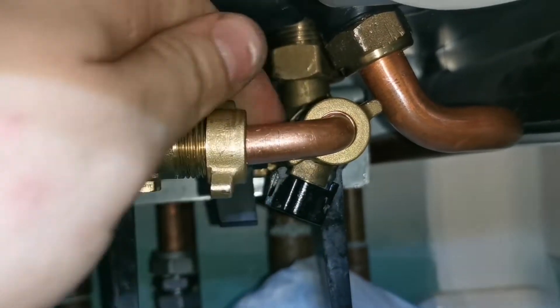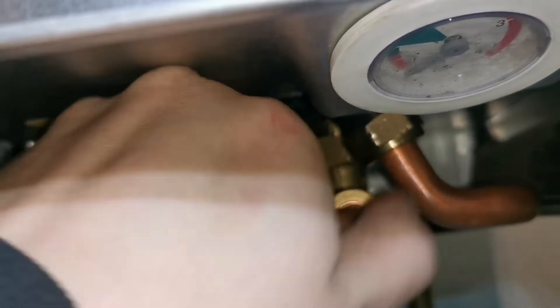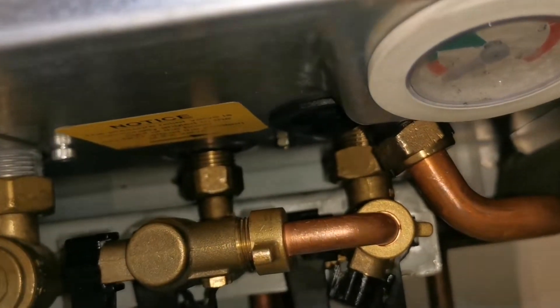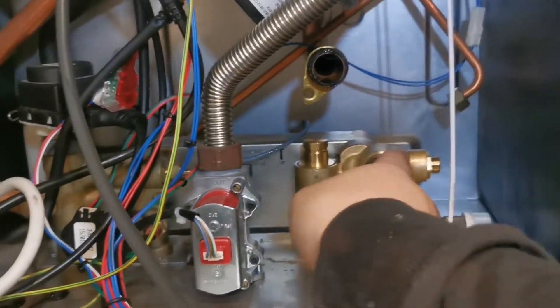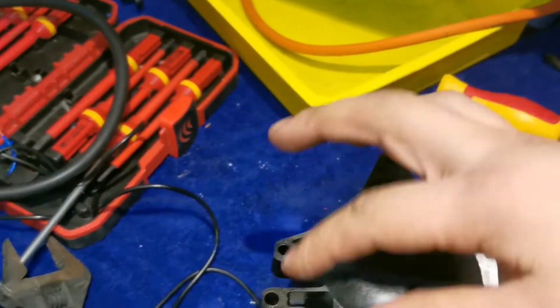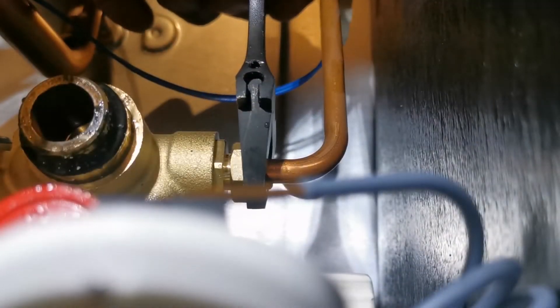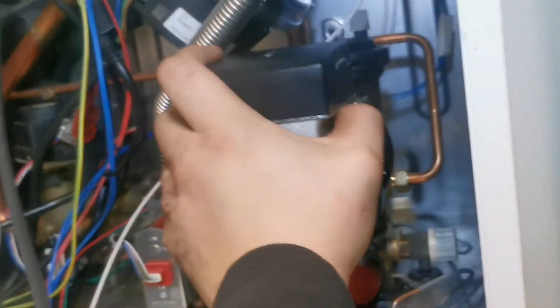Filling loop is back on — and this is when I start getting happy because I'm close to done. I'm taking my time doing that filling loop as well, making sure nothing will leak. It's always best to check now before you fill it up and overdo things rather than under-check them. Everything's in — new washer for the expansion vessel. I tighten that up and on the top I'm holding the pipe, but I've not over-tightened it, because it can easily bend that pipe with the micro bore. Pump back on.